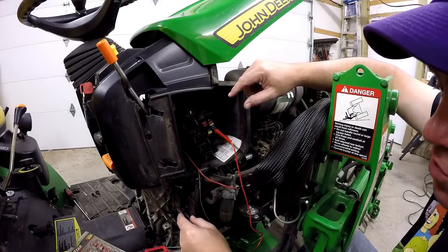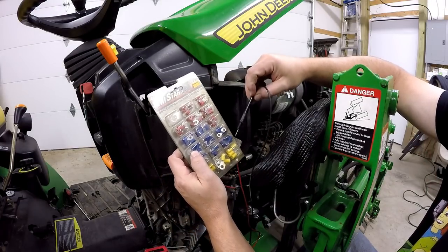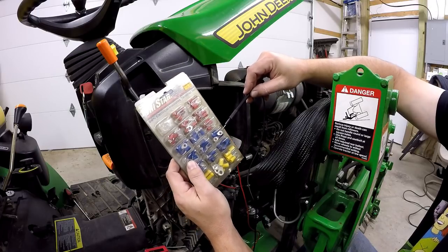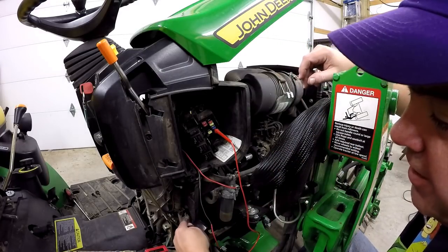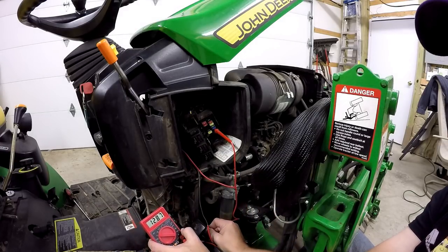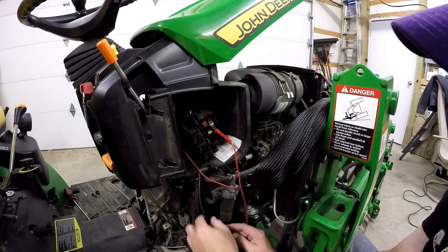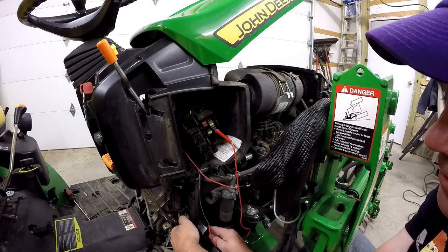And now I'm just searching for a bolt somewhere. I have this old package of terminals. This probably is 20 years old, but there are some ring terminals here that I think would work very well if I can find a small bolt to put them on. So when I'm looking around, I see a small bolt down here. The question is, is it grounded? Again, I've got the red on the power. If I touch that bolt, it shows 12.9 volts. So that's pretty good. I think we have found a suitable ground right there. So I'll put one of those ring terminals on the black end of this wire and route it right back down here and plug it in right there.